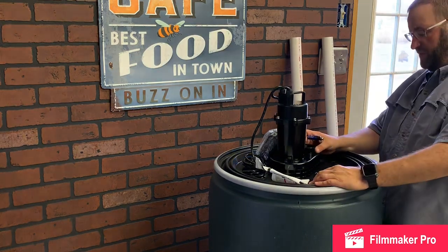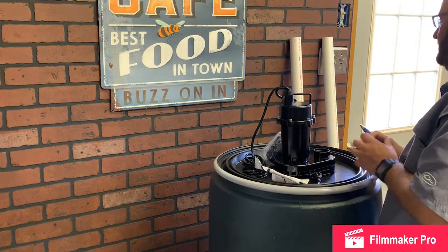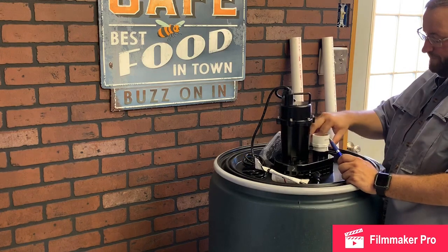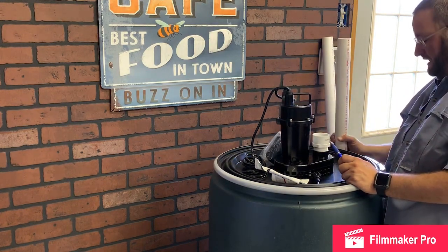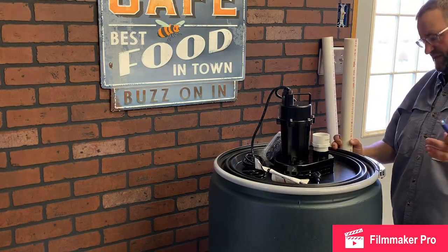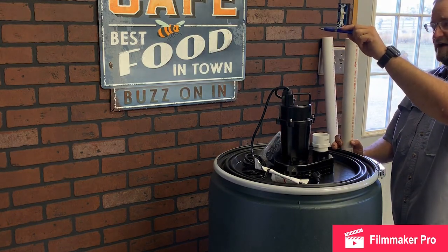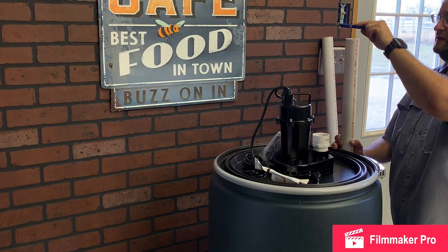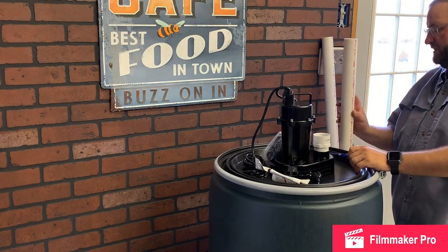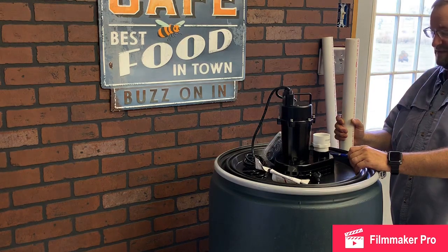So we've unpacked our submersible pump, and as you can see, we've got a fitting that we're going to use to connect the one-and-a-half inch PVC into that bottom. We're going to go ahead and measure on these pipes — your bin will be different heights, so it's not necessary to give any specific measurements. Ultimately, your pipe is going to come into this end, elbow out, we'll have our drain T valve, and that'll come around and elbow again. On the way down, we're going to put a ball valve in between so that it can be shut off.